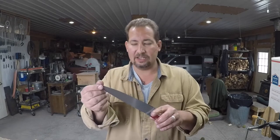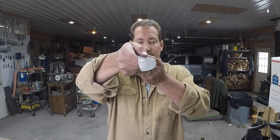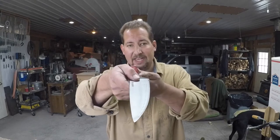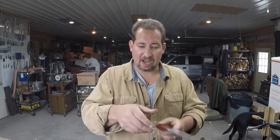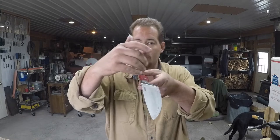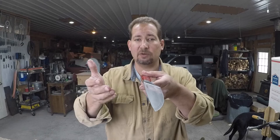If you feel like it could be a little thinner and you're not getting a whole lot of edge damage, go ahead and instead of sharpening it at the factory angle or your current angle, lay that edge back a little bit more. Keep laying it back a little bit more and a little bit more until you start getting edge damage in your normal work. Once you start getting edge damage in your normal work, stop lowering your angle. Either keep it the same and let the blade catch up, or maybe increase it, or use a micro bevel to thicken that edge up a little bit to where you don't get damage anymore.